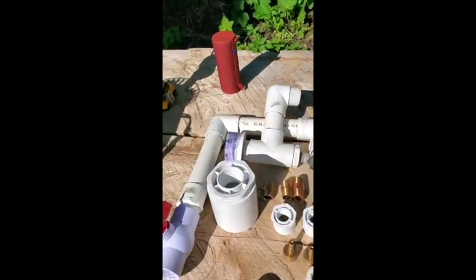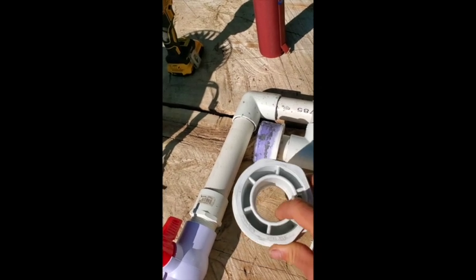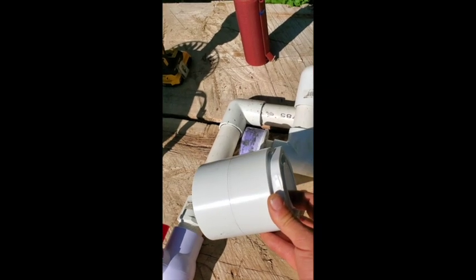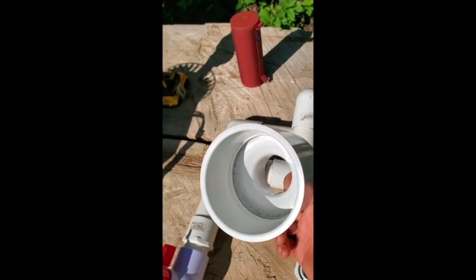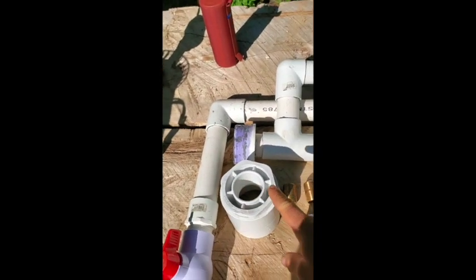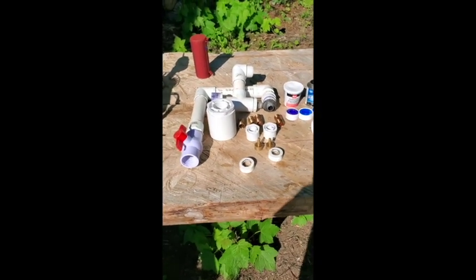This is kind of that homemade piece that failed, so we went out and got a real three-inch to inch-and-a-half full-rated Schedule 40 PVC fitting. Hopefully that glued on there. I think the most pressure in the whole system is where that 140 psi gets reduced to an inch and a half, so hopefully this with the industrial strength PVC cement will hold together.